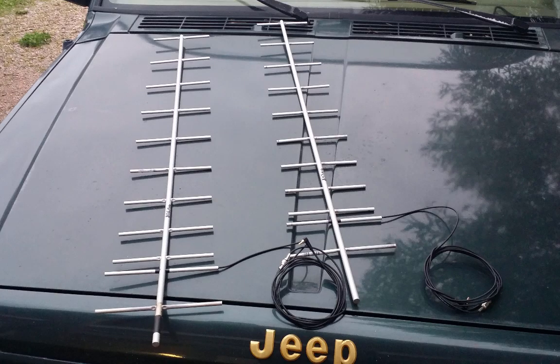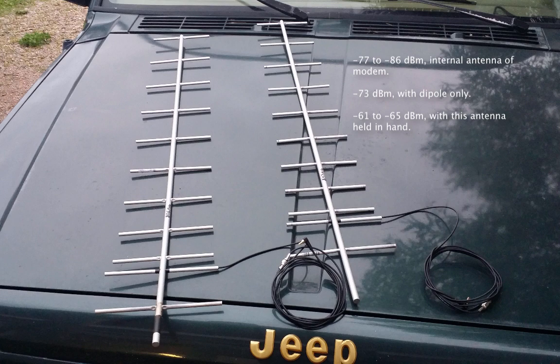Yeah, and here is the final result. I made two antennas, and that's because I want to have a MIMO connection with the cell tower. One of the antennas is constructed for 847 MHz, while the other one is for 806 MHz. That's because one is uplink and the other downlink, so I wanted to optimize them for each. The next thing will be to try them in pair and see what bandwidth I will get with this. But I think it looks promising.